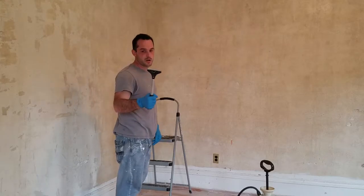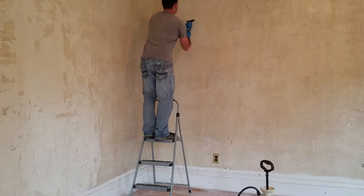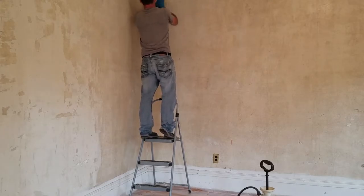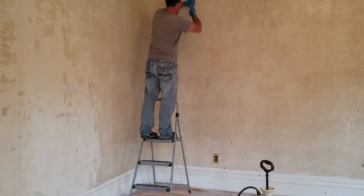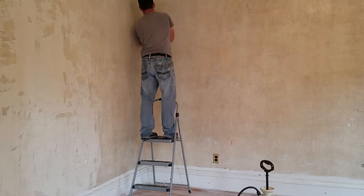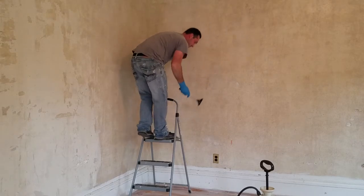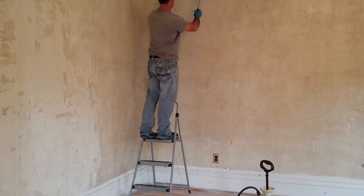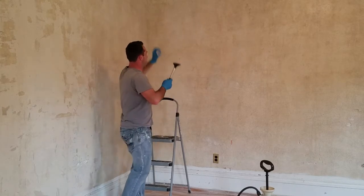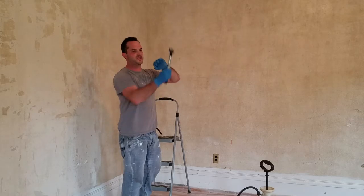This is the hardest part. You've got to use one of these nice blade scrapers. Be careful with it, and you've got to clear every area. It's going to come off. You're going to do a section this big and go all the way down, just keep scraping it until you can feel that there's no more glue on there. You'll feel it because it'll feel dry on the scraper — whereas if there's glue, it'll slide over it a little bit.